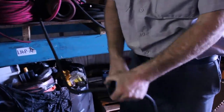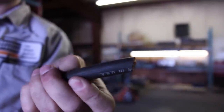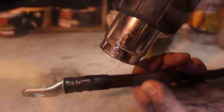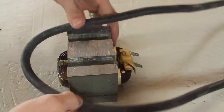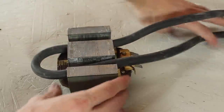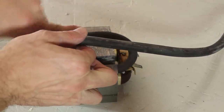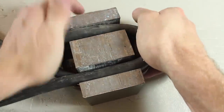I was lucky and got this from a scrap pile my brother had at work. Looking inside, you can see it's made of stranded copper wire insulated by a thick rubber coating. My brother got me a heavy duty copper lug and crimped it in place on the end of the cable. Next he added a little shrink wrap to protect the connection and hit it with a heat gun to shrink it down and finish it off. With the cable bent in half, I can move it up next to the transformer and tuck it down into the gaps. The wire is so thick it's a pretty tight fit, and probably couldn't be any bigger. I'm pulling one end of the cable back around the transformer, and I decided to switch the positions of these two so that it forms more of an ascending coil. Now I can press the other side into place, and the secondary coil is wrapped, as easy as that.